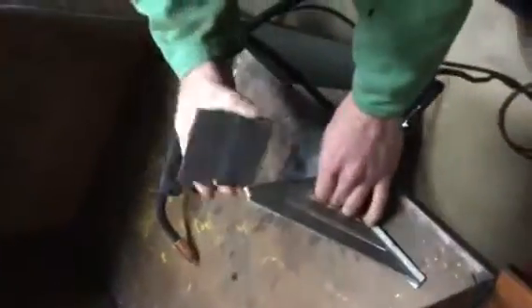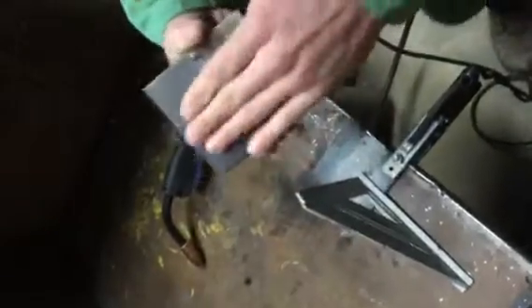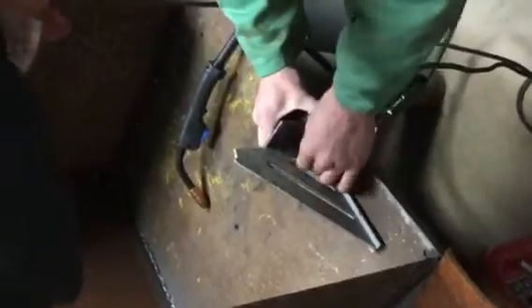The first thing we can do is hold it right directly on our marks. I'm going to pull the glove off for this so we can use it easier. Got our welding lead — get that ready. So we got our 2 marks that I made with the soapstone and the tape measure. Because this has a smooth spot here, we obviously can't use the square on this side, so we're going to use it on this side. We'll line that up on our white mark.